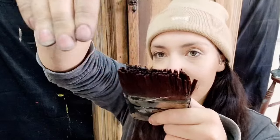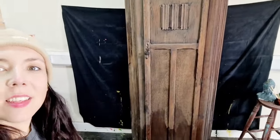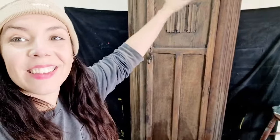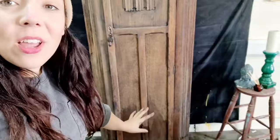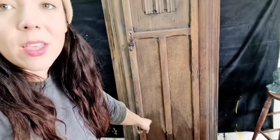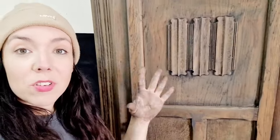The reason I'm using this particular brush — the Scarlet — is because the bristles are quite compact, which means I can get into all the corners and nooks and crannies a lot easier than a regular brush. It's still drying, but I've actually made it darker at the bottom than at the top, because the bottom of furniture is more likely to get dirty. I've just repeated the process a few extra times down there. It's not over the top — it's almost like a stain, really. It's a paint wash, meant to look rustic and imperfect to get that authentic aged look.